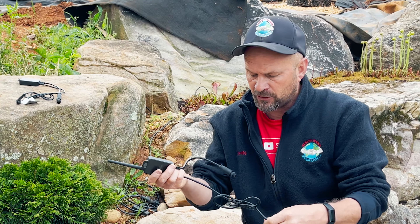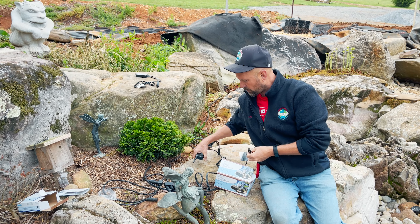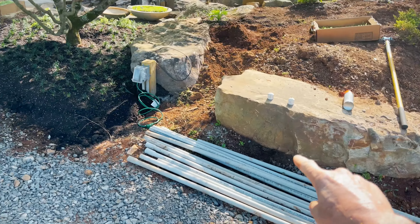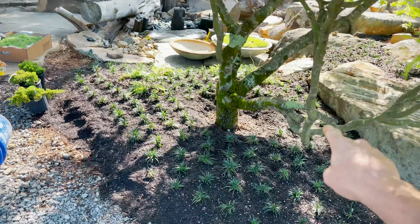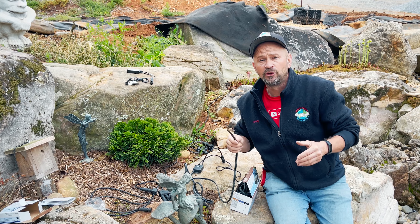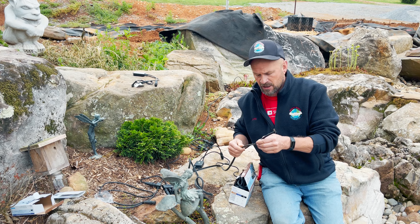The thing I don't want to do is cut this cord. This is where Aquascape has me set up to hook into my standard low voltage lighting line. The run from the transformer to here would take two of the color changing extension cables to get there. The diameter of the wires inside are so tiny that I think a lot of problems can result from doing too many runs with it. If you need one, I'm okay with that — but I don't want to just be straight daisy chaining these extension cables together, because you need to understand voltage loss in order to make all that work.